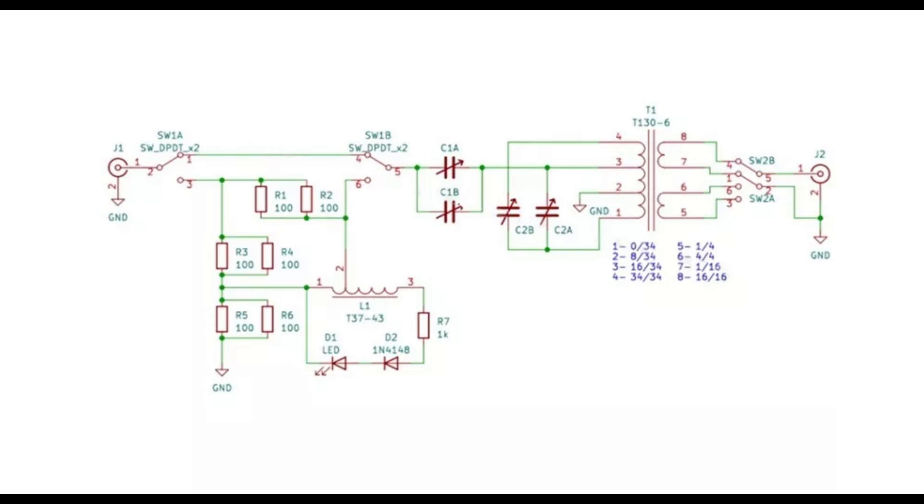Here's the schematic — I just typed 'Z match tuner schematic' into Google and found the one for this particular product. J1 is the incoming signal and J2 is the outgoing signal. The double pole double throw switch has contacts at positions one and three. In work mode the signal comes in, goes through the other pole of the switch, and into the two capacitors. Each poly cap appears to be a ganged capacitor — we have C1A and C1B, and C2A and C2B — and these appear to be in series with the inductor. The different tap points on the inductor change when you flip the high-Z or low-Z switch on the back.